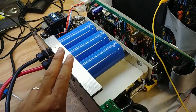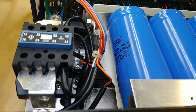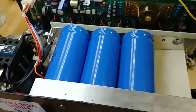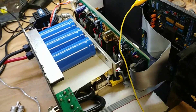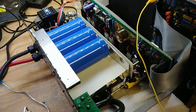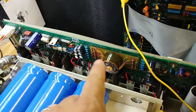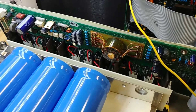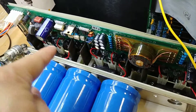Since this is a low voltage version, you can see it's missing one capacitor here. They ended up using 250 volt, 5600 microfarad caps instead of the typical 400 or 450 volt caps that are normally in here, and they use up all four. So they decided to put one less in. There are probably some other differences on the power supply board. This flyback transformer might be wound differently because it's running at a lower voltage - not sure if that's a special component.